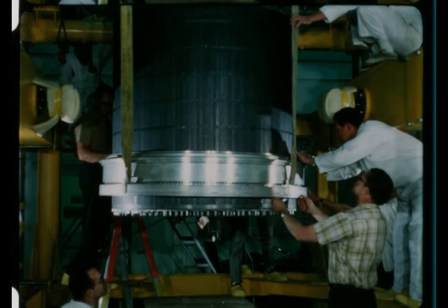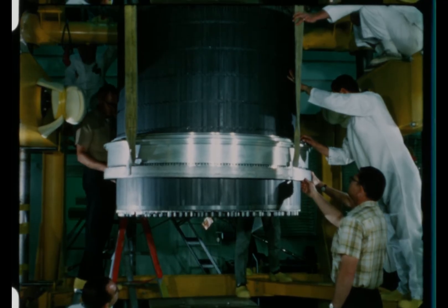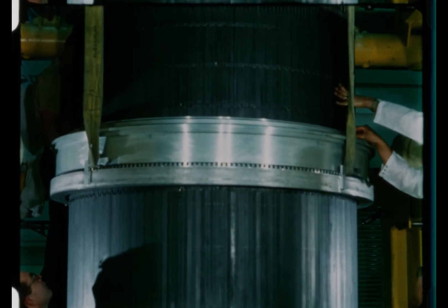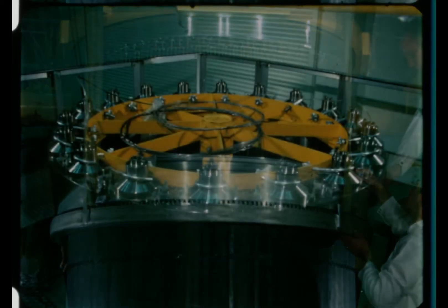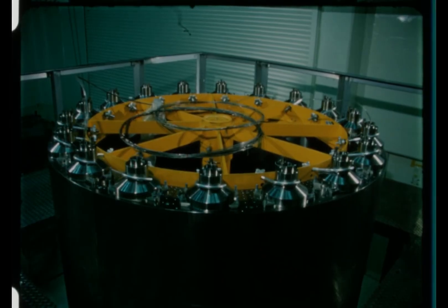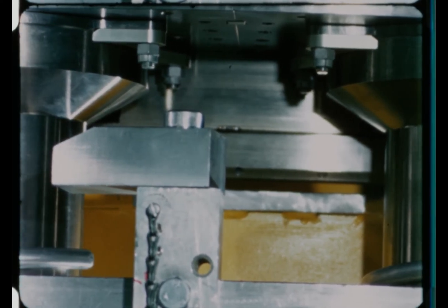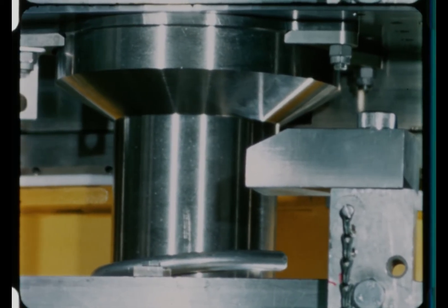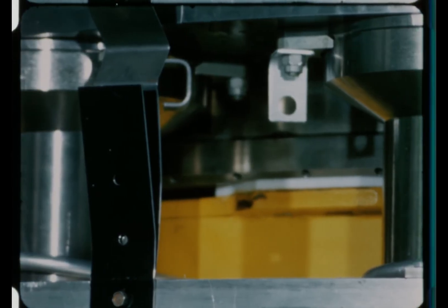In order to better withstand the greater radial pressure drop of a larger diameter reactor, the graphite reflector cylinder used in the Kiwi and Phoebus-1 reactors was replaced with an aluminum interface cylinder. Because of the difficulty of fabricating a graphite part of this size, this decision offered added advantages. Phoebus-2A's larger core size required an increase in the number of control rods from 12 to 18. Improved cooling of the control rods was achieved by using a system of stationary rods enclosed in rotatable drums. A layer of boron carbide copper cermet, one-tenth of an inch thick, was attached to 120 degrees of the surface of these aluminum drums to act as the neutron absorber.